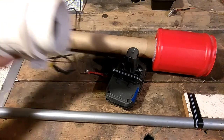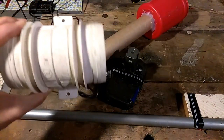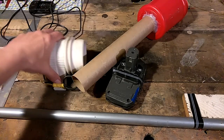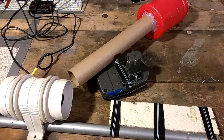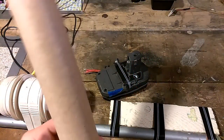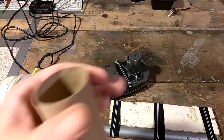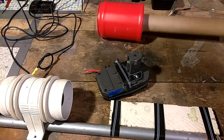As you can see here, I have a blower fan, and this is a 12-volt blower fan. These are generally used in boats — they use them to circulate air inside the engine compartment so that if gas fumes build up and you start your boat, it doesn't try to blow the hood off the boat. What we're going to do is take this, and we have this stick here — it's a broomstick — and we're going to attach that there. And then with an old coffee container and a paper towel roll, I made this duct. You can see the air will blow down through there and then blow out the end, and we can crimp this and custom make it so it blows straight down on the ground.